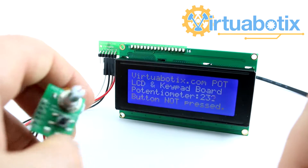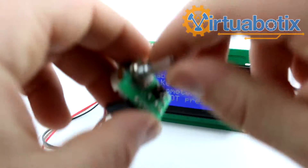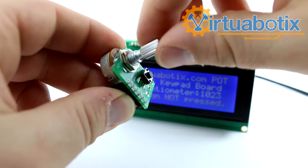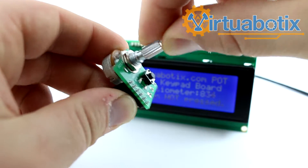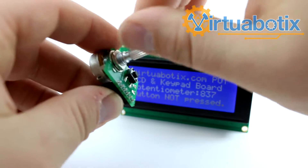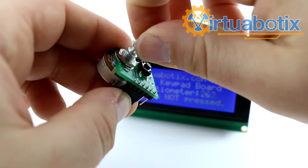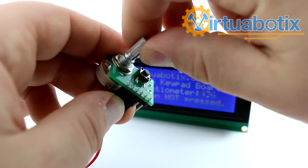As you can see on the board, the potentiometer reading is hanging around 230. Now I'm going to go all the way to 0, then all the way up to 1023. You essentially have that full range to work with on any application, and that is your 1024 resolution on your analog port. You can use this for navigating through menus or for changing actual settings within a menu.